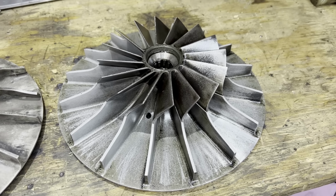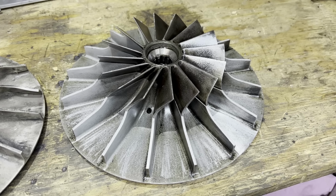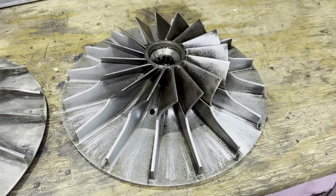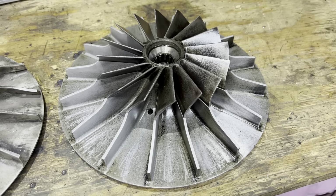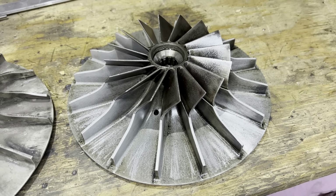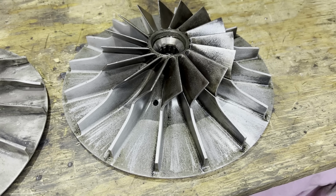And it's used on, well, it was originally used on the Merlin 45M, and it was for lower altitude aircraft. One of them would be the Spitfire Mark V, LF Mark V. And effectively what it does is it enables you to have the carburettor slightly further open for a given power or a given altitude, and you want less restriction in the inlet tract of the engine. So in an ideal engine you wouldn't have a throttle at all, and that's why diesels are so efficient, or one of the reasons anyway.